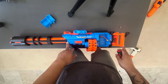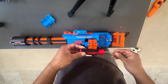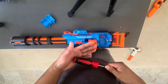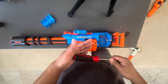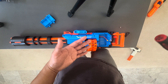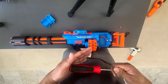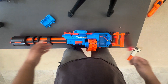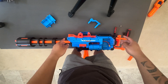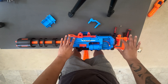There are different cage sizes depending on your flywheel. I had flywheels for my Nerf MotoBlitz and they recommend a 41mm crush, so I downloaded the 41mm flywheel cage. There are sizes: 39, 40, 41, 42. I printed a 41 but it was too much crush, so I ended up using the 40. We'll open this up and you'll see how it works.